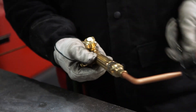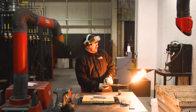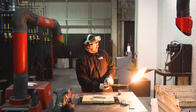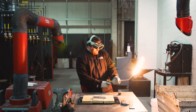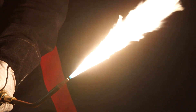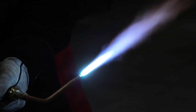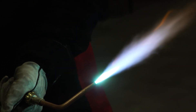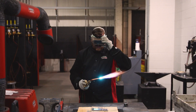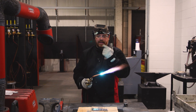We're going to start with acetylene first, then adjust our flame until the black soot or smoke just disappears. Now I'm going to drop my goggles to adjust my flame to a 3x carburizing flame. Right about here is where I want to be for the flame — now that I have my setting.